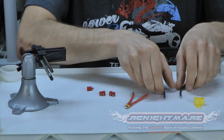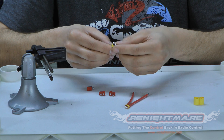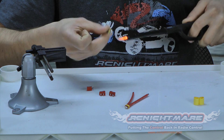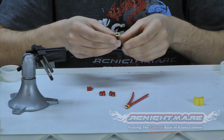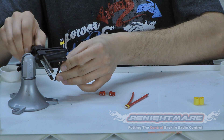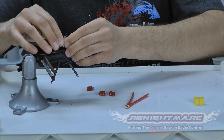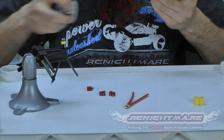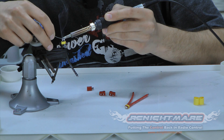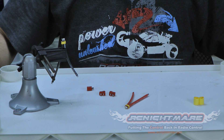We've got the red done. We're going to do the exact same thing to the black wire — just a little piece of shrink tubing over the top, get it right on the end, shrink it up. Try to make it as easy as possible for yourself now so that later on you're not struggling with it as much. I even like to angle them in a little bit toward each other to help the two ends touch. A little solder on there and just like that, I've got the two bridged together as if they're one giant wire.